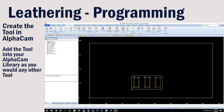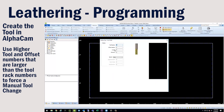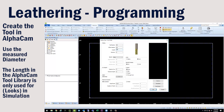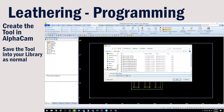For setting up our program in AlphaCam, we first need to define a tool. Select the Machine tab up above and follow to Define Tool. We are going to select a flat end tool. Our tool number and offset numbers are going to be greater than our tool rack position so we can select a manual tool change. Tool length is a generic value for simulation purposes, and diameter will match the tool diameter. Select Flood, select Fix. Spindle speeds are an average based off material type and brushes, and feed rate and down feed will match. Once we hit OK, select our tool name and hit Save.